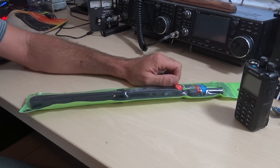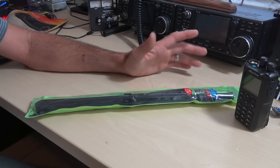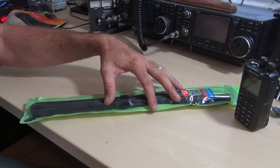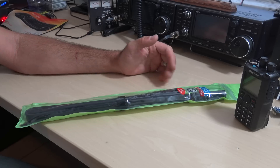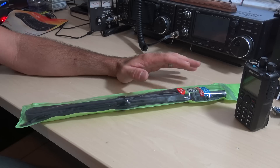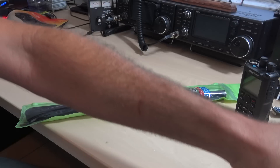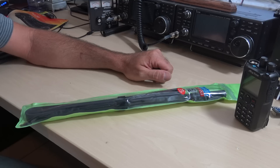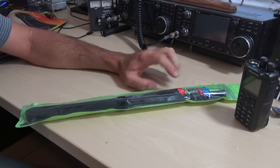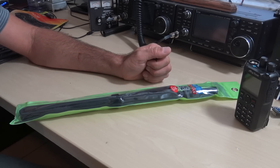I bought this and the link is in the description. I don't really know any vendors selling this or can't recommend where you buy it — just click on my link or somebody else's and go buy one if you want it. This antenna is not meant for everyone. You don't want it in your car; you're not going to use it in an elevator or on an airplane. It's a quite long antenna that's going to give you a little more gain, but it's going to be obnoxiously long. That's okay because when I'm out in the field with my go-kit trying to use WinLink or APRS or Packet on VHF, this is what I'll use attached to a handheld going through my computer and my little mobile-linked Bluetooth TNC to send email over VHF.